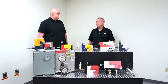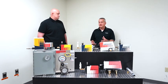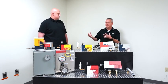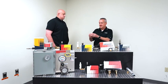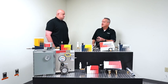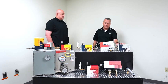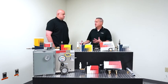If it's a new compressed air system, you may not have to change the element as much, but all of our filters are auto drain. What that means is if there's any water that accumulates in the lines, it would be separated in the filter. There's a float as the level rises, it will automatically drain. Again, we do always recommend that you supply compressed air that's dry to a minus 40 degree pressure dew point. But really filter maintenance is going to vary depending on the location.